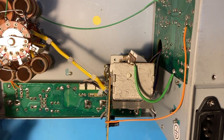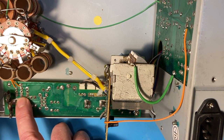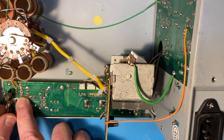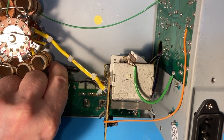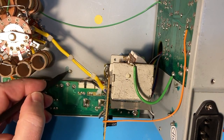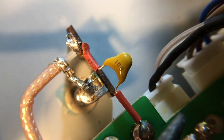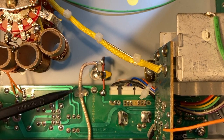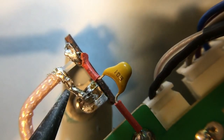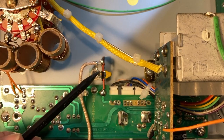Tony B had put a terminal strip through a convenient hole which is grounded, but I have my output BNC connector right in that position and I worry about it shorting. So I'm going to put a terminal strip here instead — the downside is I'll have to bring a ground out somehow. This is a short screw that goes into the plastic holding the front plate. Here's what I came up with — I was able to mount a two-lug terminal strip on that screw and it held okay. Signal ground and chassis ground turned out to be the same, so I didn't need a special wire for that. I connected the braid of the coax to ground and covered it in solder, which makes a nice firm support to hold the very delicate inner conductor that carries the signal.